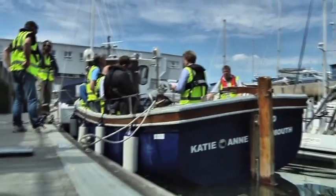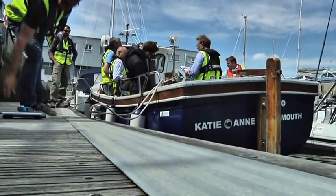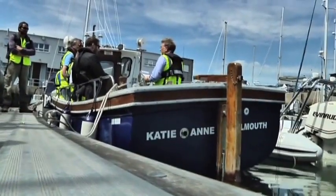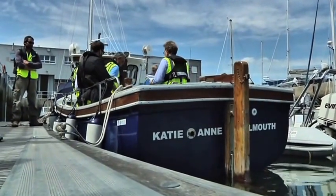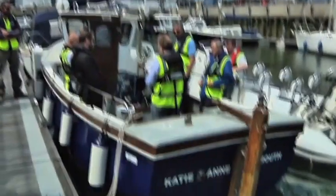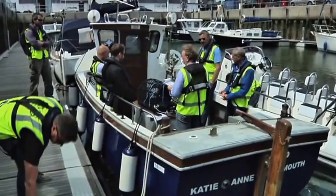Interested in the low side, we're interested in that. So the heaviest and the lightest go back over there. Right, Keith and John measure the upright freeboards again now in the condition that we've established the boat can operate with this number of people.